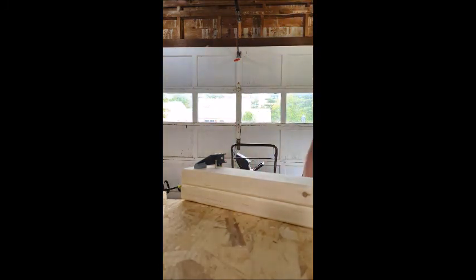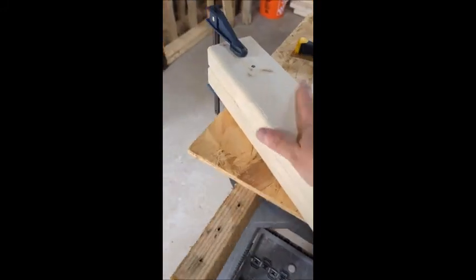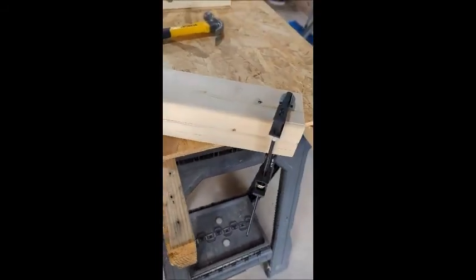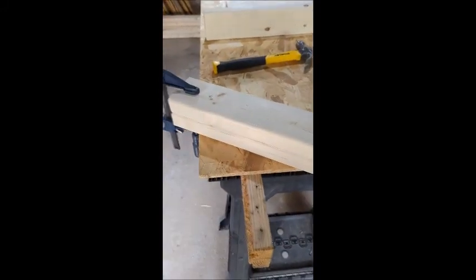The phone's probably going to fall over, but I'm just going to hammer these in. Just going to hammer those in to seal it together, and that'll be that. It's just two nails in it, and in about 10 minutes I can reuse these clamps — they're just lined up. I only did a rough sand on these, 80 grit. I am going to go over it again with 120 before I stain it. That'll give the glue a little time to dry up too, and I still have to sand all those, so the glue should have a lot of time to harden up before I really need to assemble this thing.